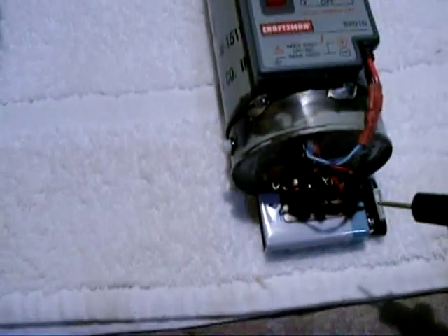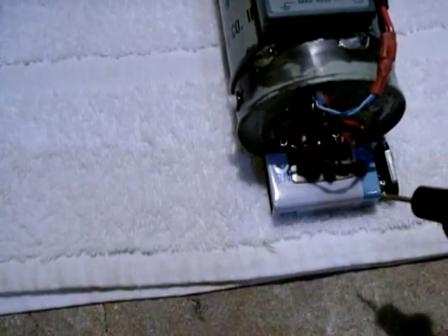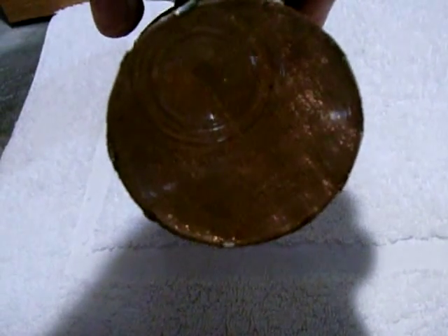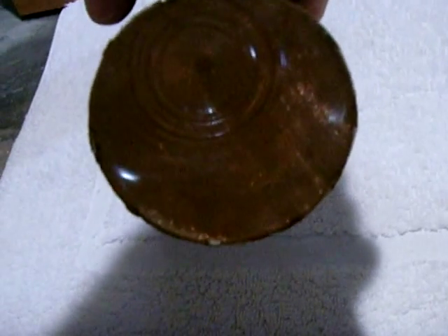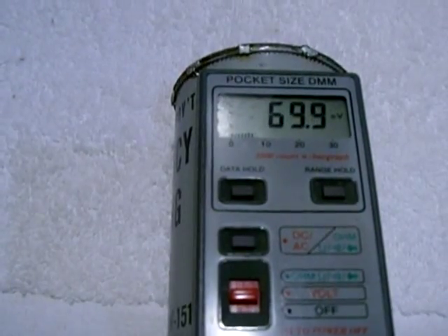Because there's not a lot of current output from this board, the digital multimeter just by testing the voltage draws the voltage down. The initial voltage was around 42 volts, but with a fresh 9-volt battery this can is charged to right around 50 volts. The reason the copper screen is there instead of mylar is to let alpha radiation enter — even a thin piece of mylar ends up blocking the great majority of alpha radiation, and only the highest energy alpha gets through. So I wanted everything to enter the can. You also have to be aware that when using an ionization chamber with an open-end screen like this, humidity can affect performance.